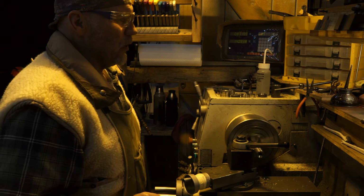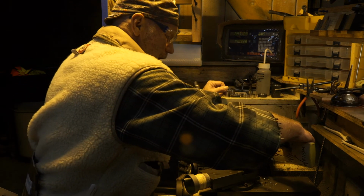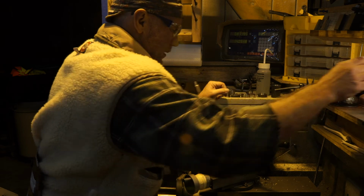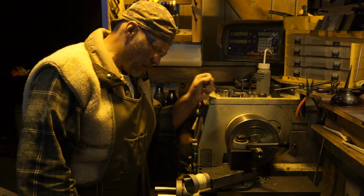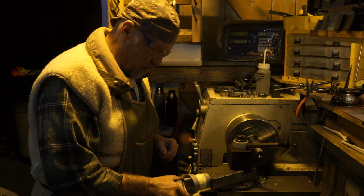Okay, now at this point, let me dribble a little something on here. It's mainly to just cool the bit, just a little. I'm going to go ahead and take another 5 thou pass because I'm going to slam up on the 0 pretty quick here because I want to.